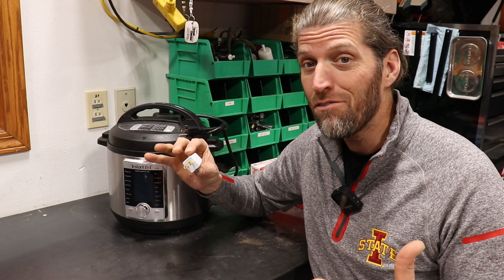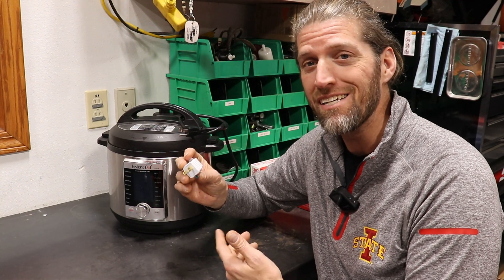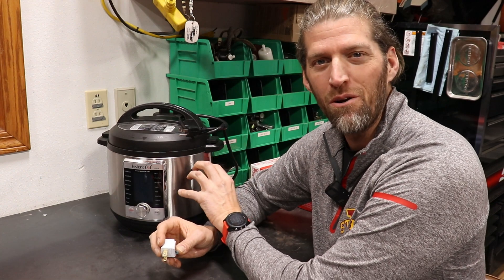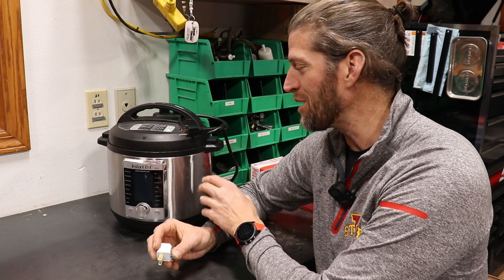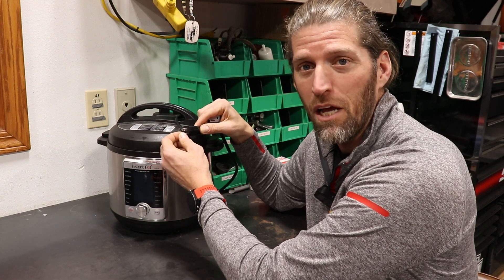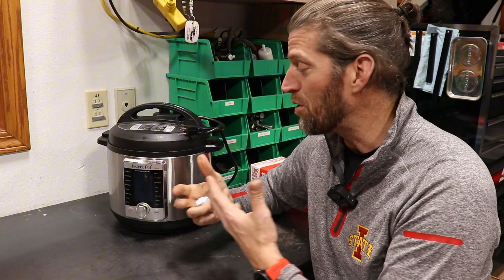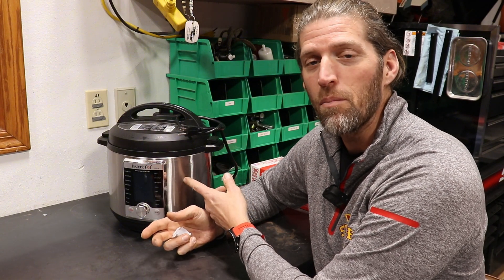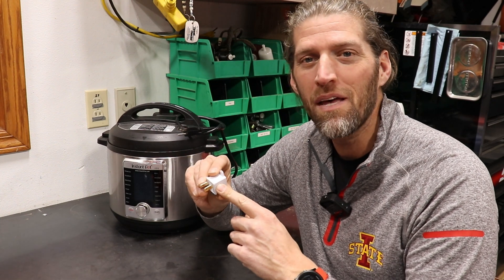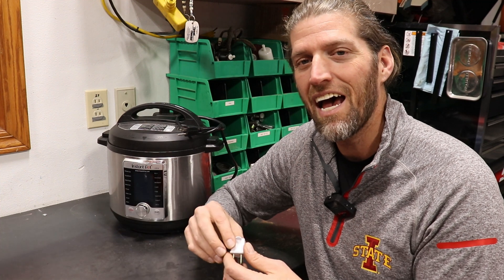So is the use of this device safe? Well, safe is a relative term. Just know that if you use one of these devices, you are likely eliminating the safety protection of grounding if there was an electrical short inside of that device. The same thing would be true if this grounding pin broke off the electrical connector, which happens all the time — you're effectively losing that grounding protection and you're probably still using it. Hopefully that helps clear up some myths on what these adapters can and can't do and the risk that they add.